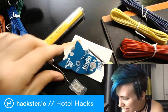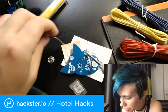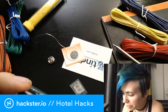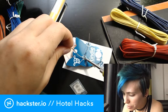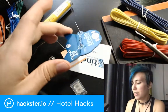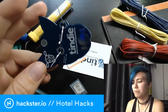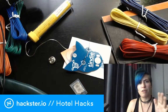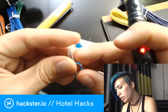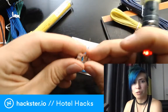They only sell lead-free solder, and this USB iron has a little bit of power issues. This is also lead-free solder, which means it likes to clump up, doesn't really stay melted, and has a very sharp cutoff melting point, which can make it really awkward to work with. The nice thing is that because of that, it hardens extremely quickly and goes solid, so you don't have to sit there and blow on it like you might with rosin core lead solder.